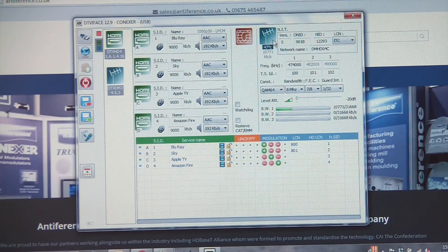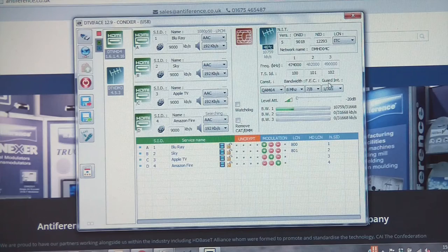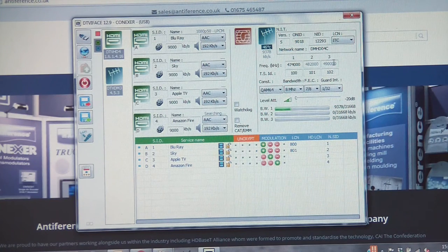Over on the right-hand side is the modulator section. The top line — the NIT section — are factory settings that don't need to be changed. You can always refer back to these on this video at a later date should those values have changed. Just below that are our frequency output settings, which is our channel number. There are three of them because we've got up to three multiplexes available, and we can assign the inputs to different outputs however we want. Factory setting is for output one, the primary output, to be set to channel 21. The other two channels will automatically link and follow wherever you set channel 21 to, sitting adjacent one and two channels above respectively. Make sure you leave enough space in the band if you're using all three.